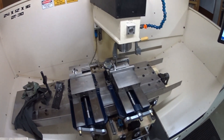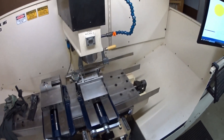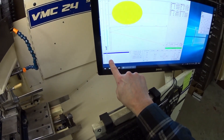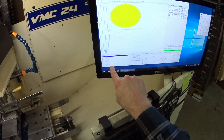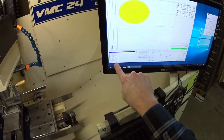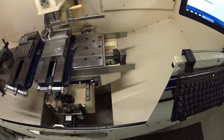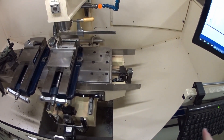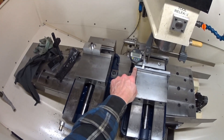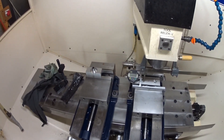So this is my crude test for checking actual motion error. I've got a little program that simply starts from a zero position and moves in five thousandths steps, with a four second dwell between moves. Five thousandths is about one tooth on the sprocket, so the entire program will be basically one revolution of the ball screw. After each move, the four second dwell lets me record the reading on my precision indicator, and then I can compare the commanded move to the actual move and look for the error.